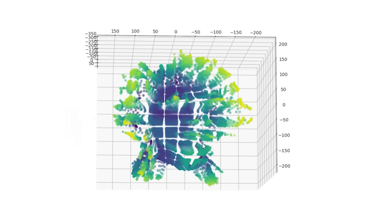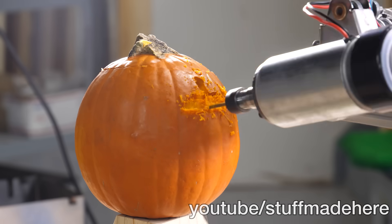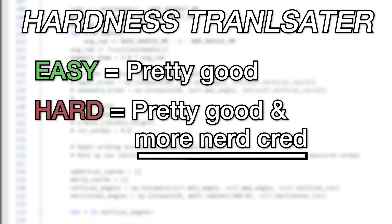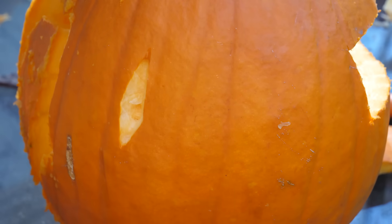Writing the code for all this is just describing everything to the computer in excruciating detail. Congratulations — we can now wrap a meme around a pumpkin. The final boss step is turning this into a series of moves for the machine. I want the robot to do two things: cut out shapes like old-school pumpkins, and cut lithophanes. The idea behind lithophanes is that you vary the thickness of a translucent material to get different shades — this gives a lot more detail than cutting out chunks, because it has shades of gray. I programmed it to have 254 shades.